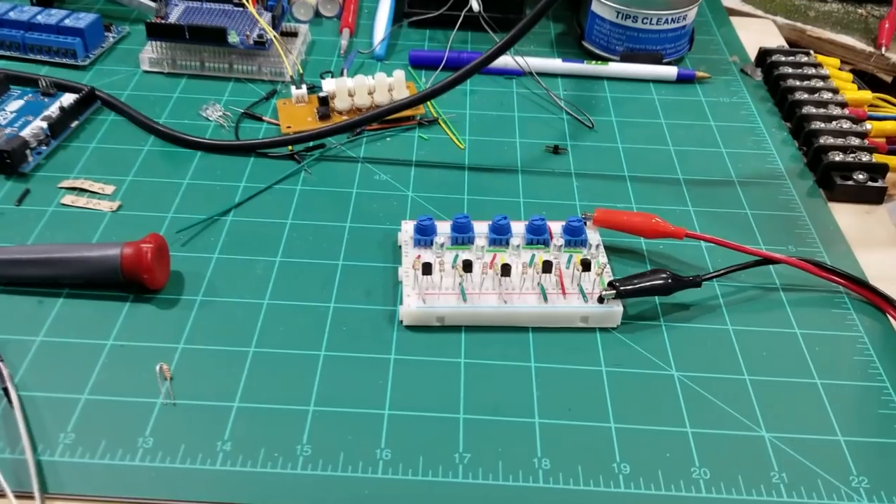In the next episode, I'll show you how to go from a bare breadboard to the finished circuit, going through all the steps of assembling it. I'll also show you how to make the rectifier — both with four individual diodes and with the small dedicated rectifier component, which has four pins: two for AC and two for DC — so you can hook it up to your power pack on the AC accessories.